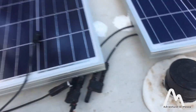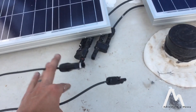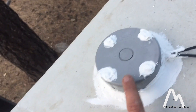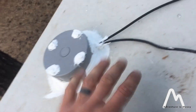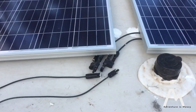Guys, I wanted to show y'all — it's getting dark and I'm about to go in. I've got everything done except for these tied in and the positive wire. I didn't want to tie these in yet because I think you can get shocked just by hanging out since they are producing energy. But I've got this all caulked up where the wires are actually coming out. I'm paranoid of leaks, so I even caulked the little screw heads — and this is supposed to be weatherproof even without that. These breakouts aren't broken out, but I can bust one of them out, scrape the caulk off, pull the lid off if I want to run additional wires down there. I've left just enough slack to get them hooked up and then pushed under there, and I'm going to use some little ties to clean up the wires. I think I'm down to installing my charge controller and then running my positive wire to the battery.